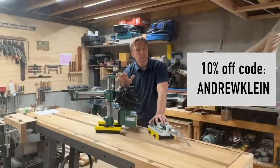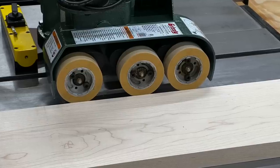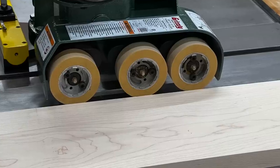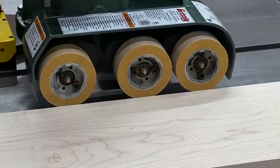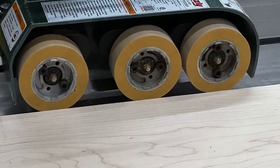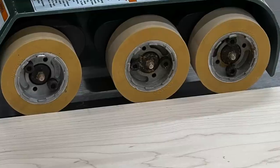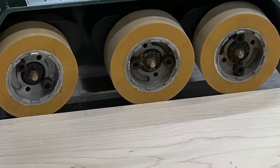I've got just a couple more tips and backstory to cover before wrapping this one up. First off, there are some other content creators making videos for these products, and I'm going to list their videos in the description. And secondly, if you're new to power feeders like myself, a couple tips for you: I found that it's a bit fiddly of an operation to try to get the wheels exactly level with the workpiece. It doesn't have anything to do with how you mount it, but I've found it a little bit time consuming, but also surprisingly important — so my recommendation is that you take the time to get it right.